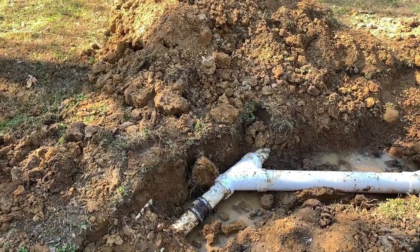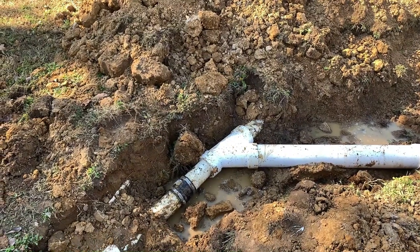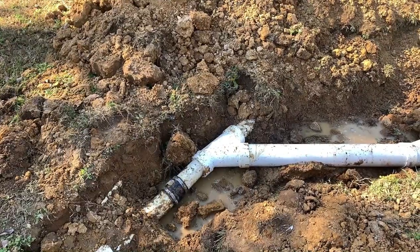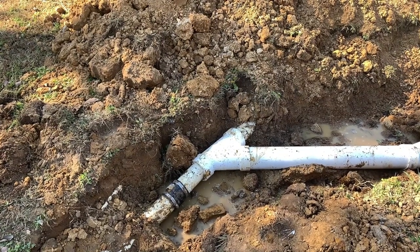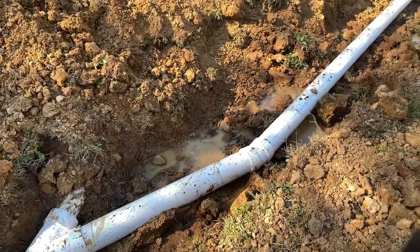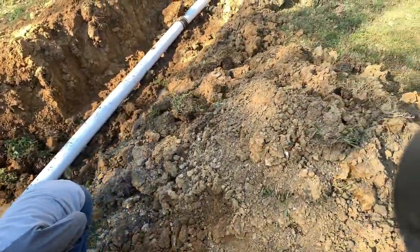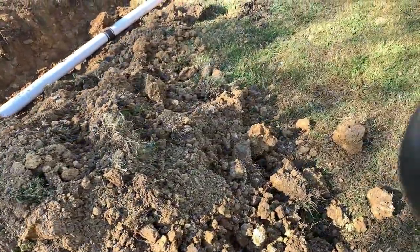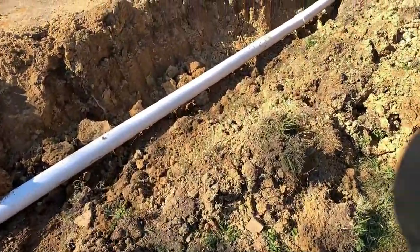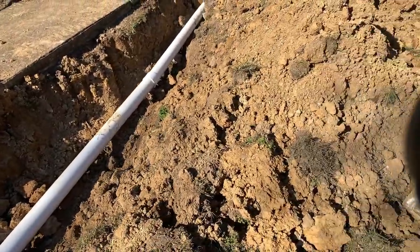already installed pipe, you're going to need to use one of these stretch fittings, because you can't piece in without having a little bit of room to piece in that T or that Y. It's actually a Y connector. And then we used a 22 degree angle. We used another stretch coupler here just because 22 didn't put us exactly in line, so we were able to bend it just a little bit to get us a nice line and use traditional couplers the rest of the way.